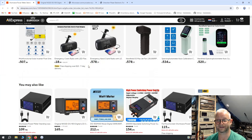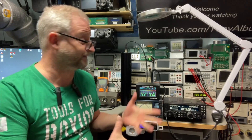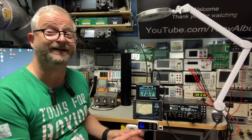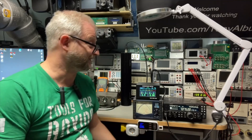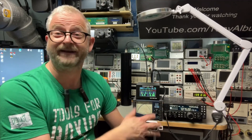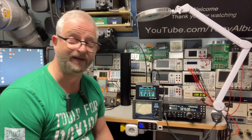I sent another email a week later hoping they would respond, but they wouldn't. I connected it and transmitted on 20 watts and it said about 4 watts, and the SWR was 1.6 while it was on the dummy load. I can clearly see that the Diva thinks it's 20 watts and the SWR is perfect, yet the meter says 1.6. Then I put in around 70–80 watts, and it read only 11 watts, still with SWR 1.6. That is not going to work — and knowing the support from this supplier, it's not going to work.